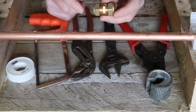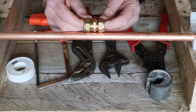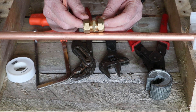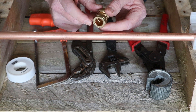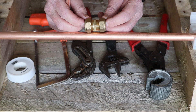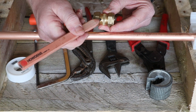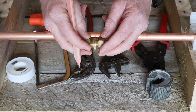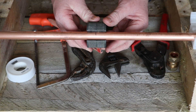The limitation with a compression fitting is space. If you are limited for space, another fitting might be better — either a push fit or a soldered end-feed fitting, which I'll cover in two other videos. Today we've got plenty of space, so for demonstration purposes I'll show you how the parts go onto the copper pipe. First, decide where the fitting needs to go — the pipe would roughly work from the center — then mark the pipe and use the pipe slice to cut over that line.